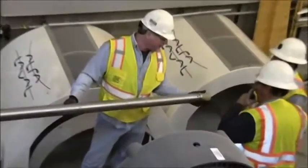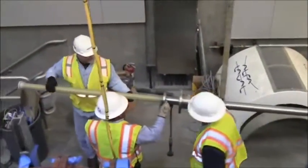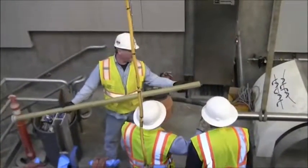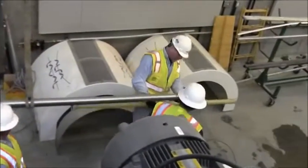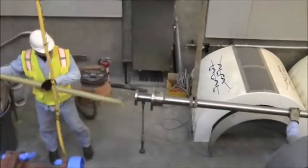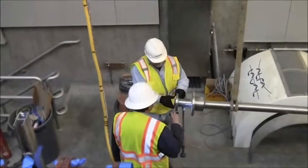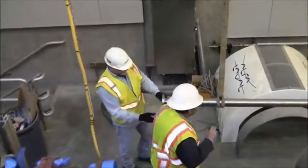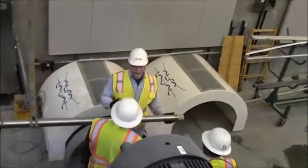There's an O-ring on the inside, an O-ring here, and an O-ring on the face on this end. Here's your tube within the tube — you have a groove for your O-ring, and your other O-ring on this end is face-mounted. You've got to make sure you have both O-rings so this thing won't rattle around in there. Put both O-rings on, lubricate them up, and just slide this in. The end down there is tapered so it doesn't take much to get it going. Your polymer comes in here, goes around that inner glass tube, and comes out these holes — that's what we call internal polymer injection.